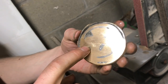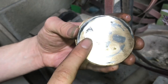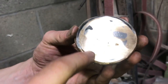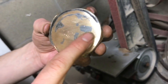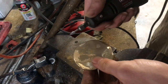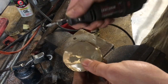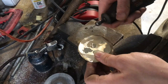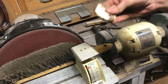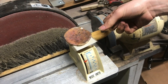There's still a little bit of steel left. I'm noticing some pits in the surface, probably from gases at the bottom of the can that got trapped trying to escape. Now I'm getting rid of these last few bits of steel. I didn't want to have to grind off all that material just to get the last bits, so I'm just using the Dremel, cleaning it up. Here's the bronze — I've gotten rid of all of the steel. This should be just about pure bronze.